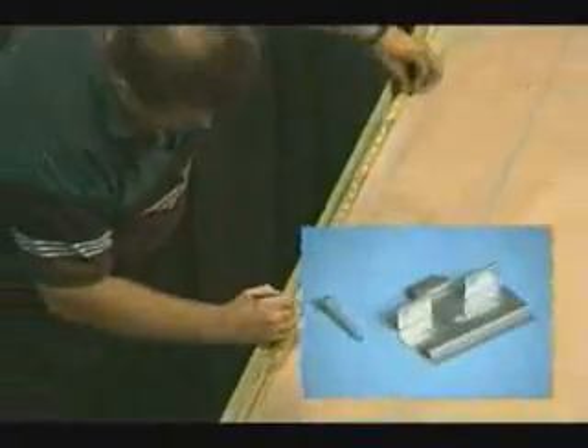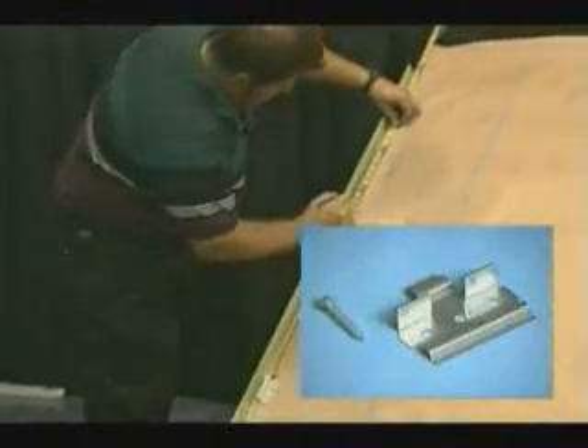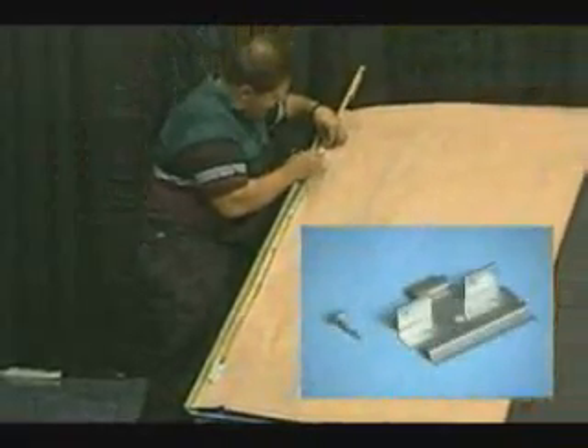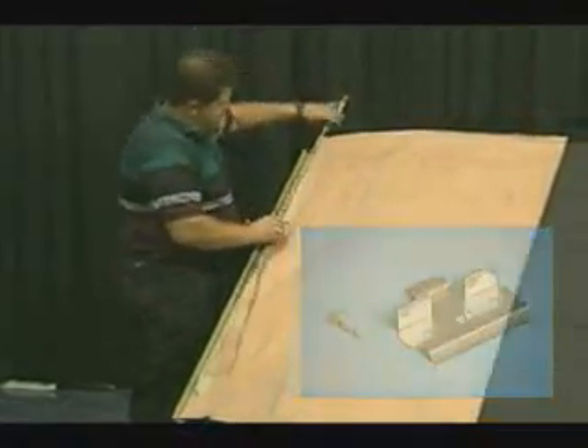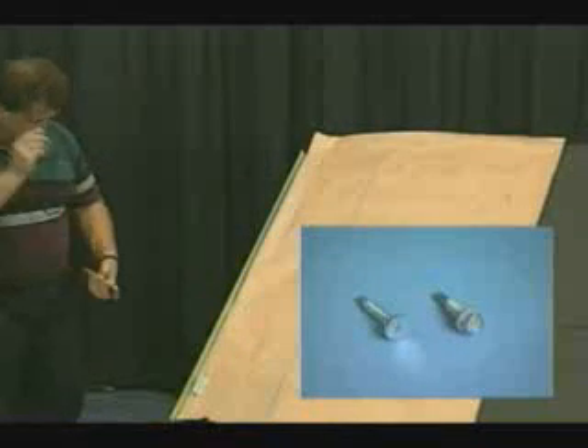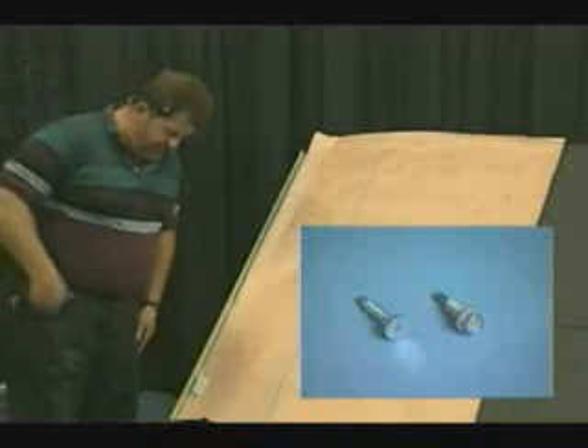There are some made out of stainless steel and galvanized steel that are designed to elevate the panel above the substrate, or if it is open framing above the purlins. This not only elevates the panel but allows you to use hex head fasteners rather than the pancake head type screws which must be used with the flat clip.